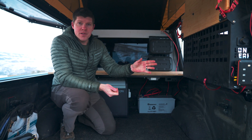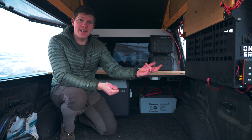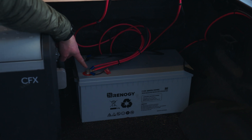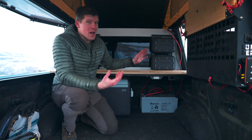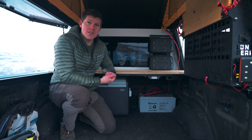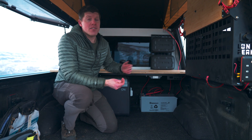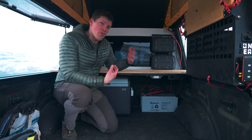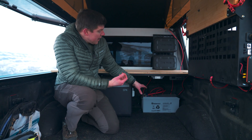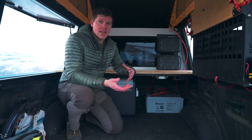Juice Box is powered from a 12-volt battery. If you have a Goal Zero or Jackery, you could use that and just plug it straight in. I personally prefer using a separate deep cycle battery. We don't recommend plugging into your truck battery — it's not really designed for constant current; it's designed to start your truck. In here I have a Renogy 200 amp-hour AGM battery. It's super heavy, so I'm probably going to change to a lithium iron phosphate, which does better in the cold and is a lot lighter. We're going to test out a bunch of batteries and share our recommendations.